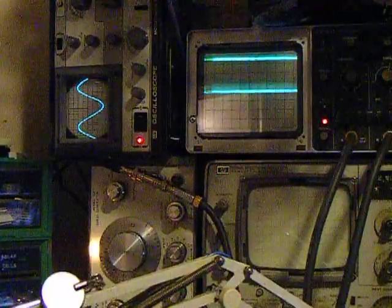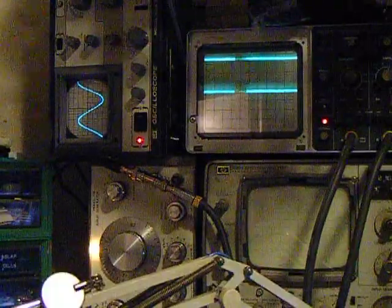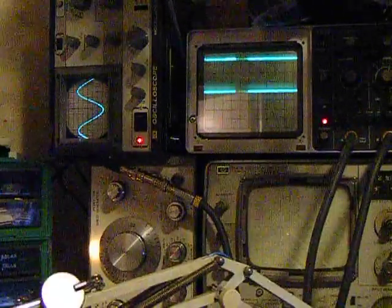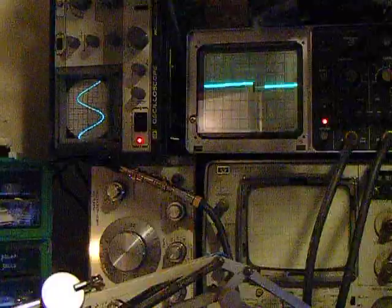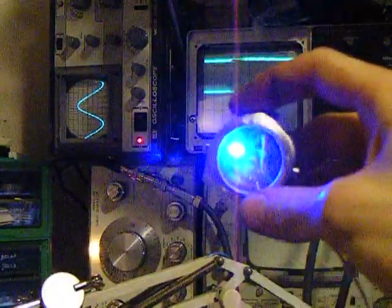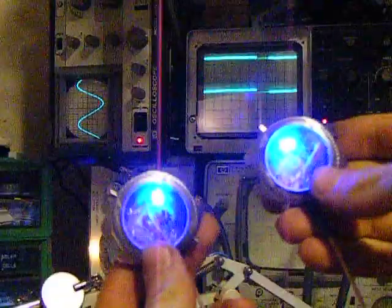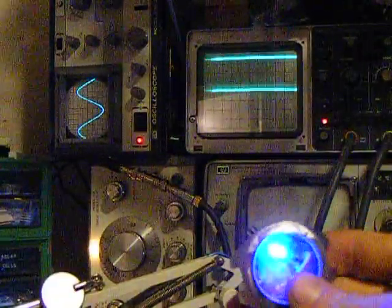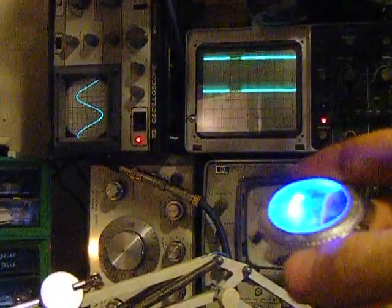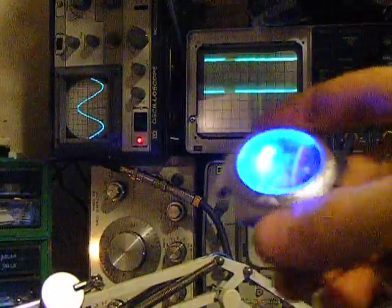What you're looking at is the scope output of two envelope tracking circuits that are listening to a pair of contact microphones, but they're kind of a weird design. I've taken watches — I've done a couple of these now and I'm working on more — and built inside a contact microphone, sort of, with a two-stage transistor pre-amplifier circuit.